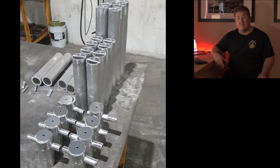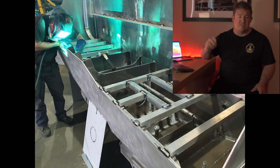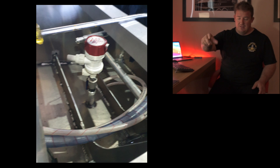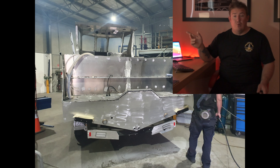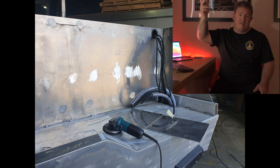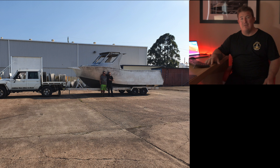The bollards were made from scratch — just piping and round bar that's been machined and fully welded by Mark. I wanted to keep the transom nice and clean, so two cartridge pumps — pipe with a threaded fitting on top with a seacock, and then the cartridge pump on top of that. Then came the point to enclose the transom — you can see the plates down, and we've run a few waterproof fittings to run wiring out of it.